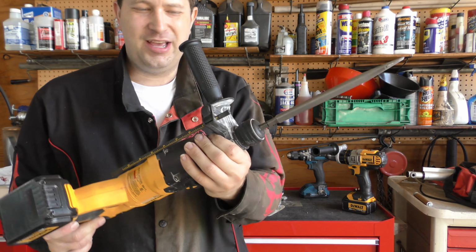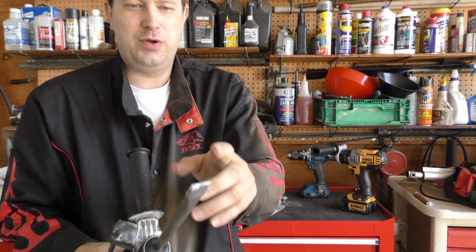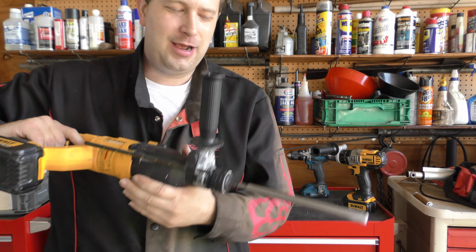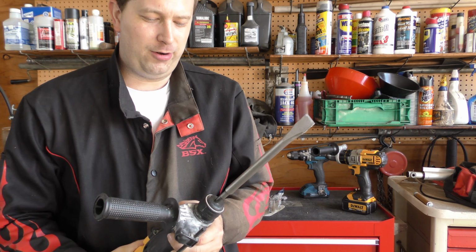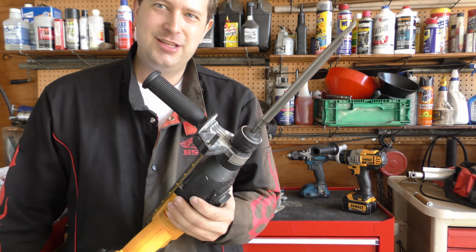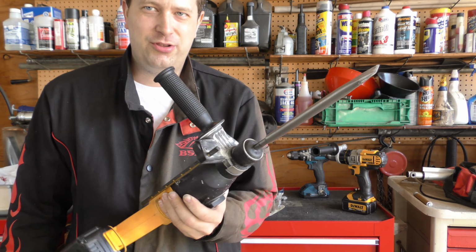What we ended up doing, we took this, we have a little bit wider one, I think I got a 2-inch one here. Took the 2-inch one and just went in hammer mode along the floor, breaking up the tiles and the grout that was on the floor, and then went through and cleaned it up. This worked really, really well for removing the old tiles. Again, nowadays they always put that extra layer, so you could probably get under the board. But in this case, it was adhered right to the subfloor, so we had to get under that with this. Within maybe 10 minutes, we had that whole tile floor smashed to pieces, swept it up, came back through, got all the grout off with this as well. So this is a good use for this, by the way. It works really well for that.